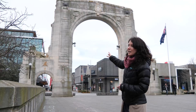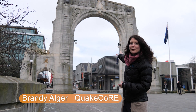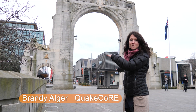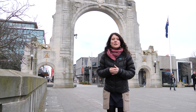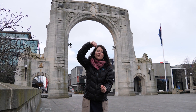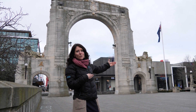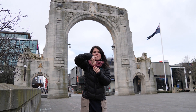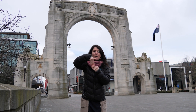After shaking, the right side of the Bridge of Remembrance actually sank quite a bit further than the left side, just like we saw with the house. Engineers needed to raise up the right side, and how they did that was by putting piles — they drilled really long tubes, 26 meters down, and filled those tubes with concrete. So all along the base of the Bridge of Remembrance are 26-meter-long tubes full of concrete to help keep it on top of the land.